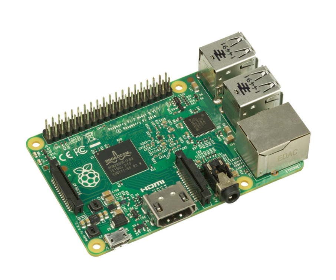Single-board computers were made possible by increasing density of integrated circuits. A single-board configuration reduces a system's overall cost by reducing the number of circuit boards required, and by eliminating connectors and bus driver circuits that would otherwise be used. By putting all the functions on one board, a smaller overall system can be obtained, for example as in notebook computers. Connectors are a frequent source of reliability problems, so a single-board system eliminates these problems. Single-board computers are now commonly defined across two distinct architectures: no slots and slot support.